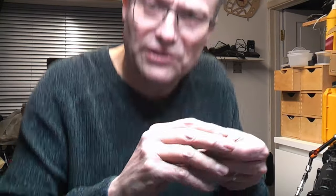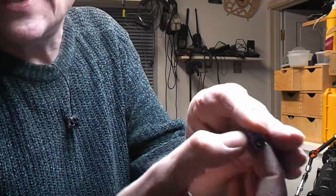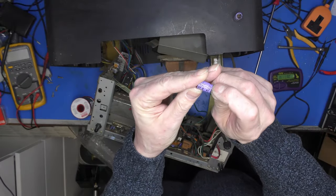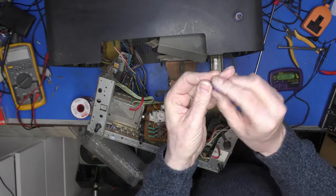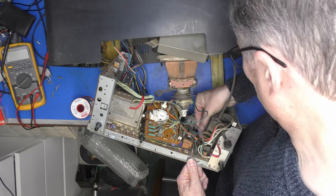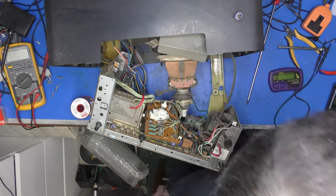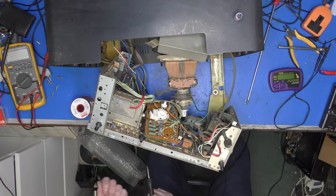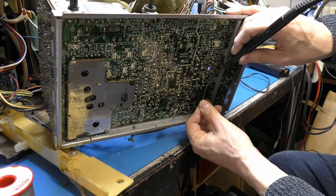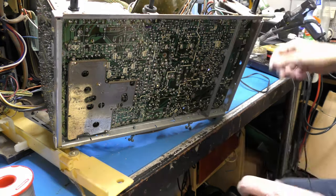This is quite a rare thing. We see them every now and again. They aren't very good normally. If you can see on there, I shall hold it up to the big camera. Look. You see that? It says BP, bipolar. It's a non-polarised electrolytic. It'll go in either way around. And they generally do have a little bit higher ESR than the usual anyway. So, yeah, he's bipolar. So that can go any which way round it likes. That's that back in.